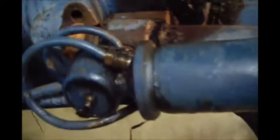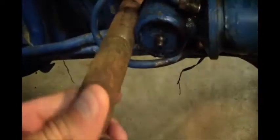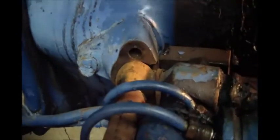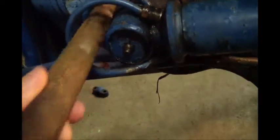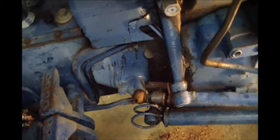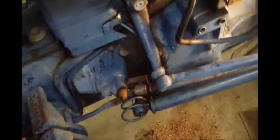Taking this cap off, I ran that nut out to where it's sitting proud on that, so the nut's actually pushing up against the block in the case, and I stuck this old pin I had in here and just knocked that in. That actually worked out real well. Only took about two hits. So that's how you break these taper press fits loose.